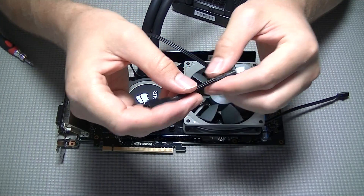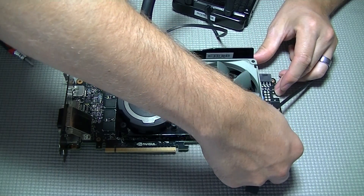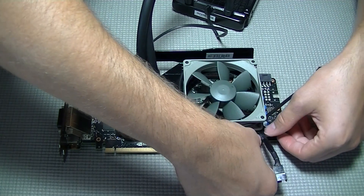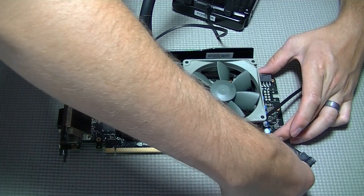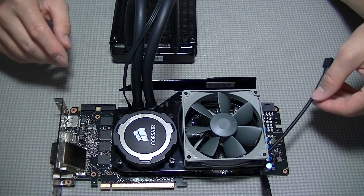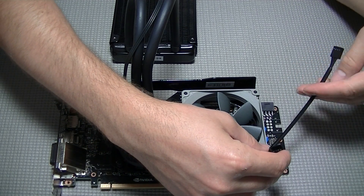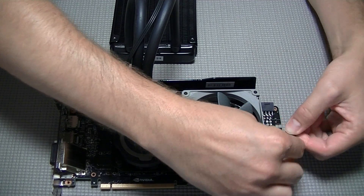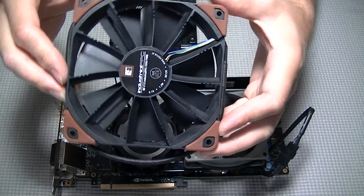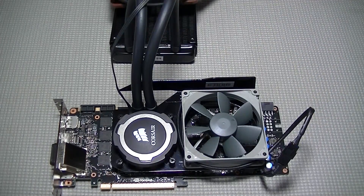I forgot to install the adapter cable for the fan header — this allows your graphics card to power the fans itself as long as you're using PWM fans, and a link is included in the description. Ideally it would be installed before the bracket, but you can bend the cable to the side and fit it underneath if needed. It's not strictly necessary, but it's a nice feature if you want to set fan profiles and let the GPU control fans based on temperature. I've also connected fans directly to motherboard fan headers via the BIOS, but the results are more satisfying using the fan header on the GPU itself. I've also included a multiple fan adapter so you can connect multiple fans directly to the GPU.